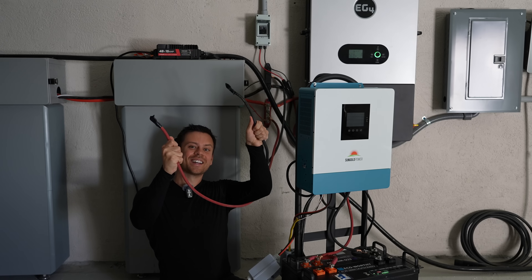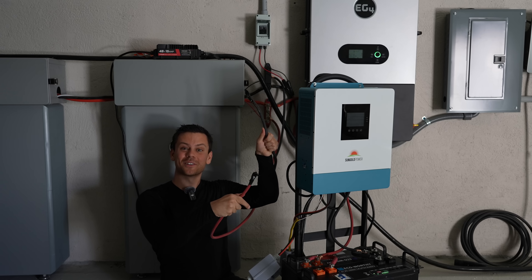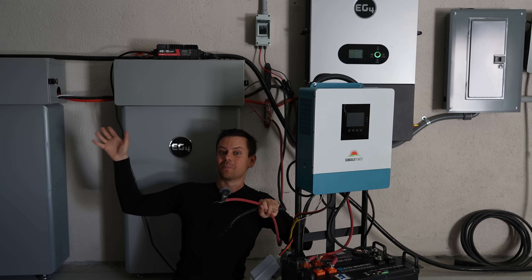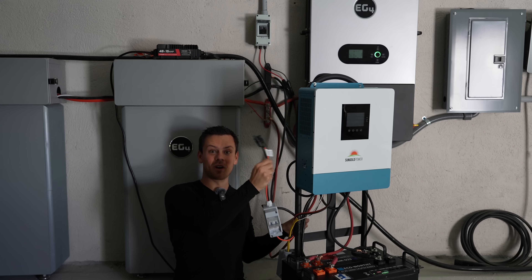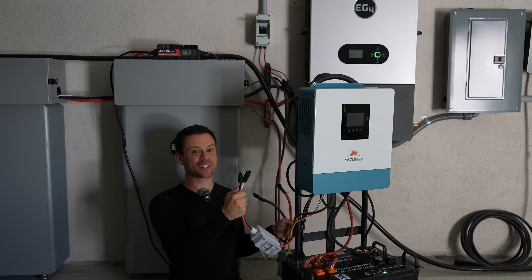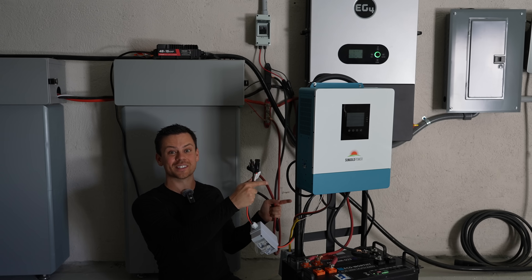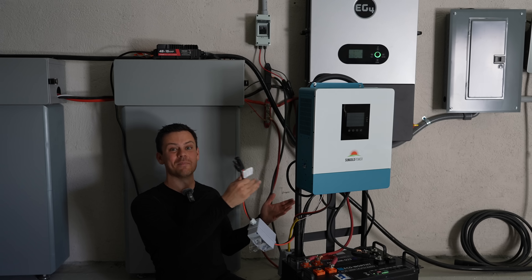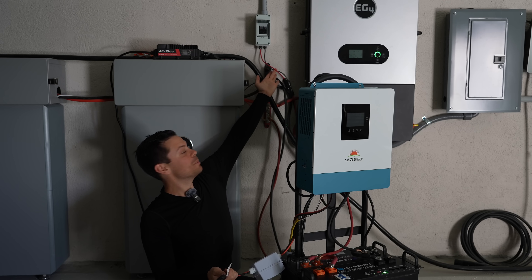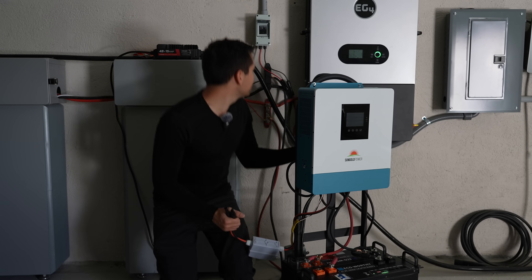This is how I connect it to the bunker vault. I put these server rack batteries in parallel with this massive 60 kilowatt hour battery bank, and then I connect the solar right here — this is where I connected the carport. But that was complete overkill; I just wanted to put a lot of power through this thing to see if it would break. I got to max it out, which was fantastic. But for now, I'm just going to connect the bunker vault solar array.